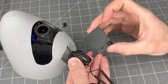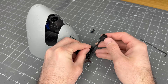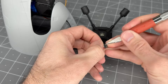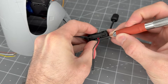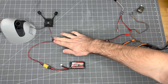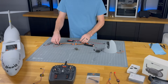Now we're going to mount the air unit onto the mount using longer 2mm screws, though there are holes designed in so you can use zip ties if you'd like. Now we're ready to mount this into the fuselage, but first let's talk about wiring the air unit. I have the wiring harness stripped down to bare minimum — just red and black wire. To power the air unit you need at least 7.4 volts. The simplest way is to put a separate battery pack in there — at least a 2-cell battery — and plug it right into the power leads on the air unit. The other option is to run off your flight pack.